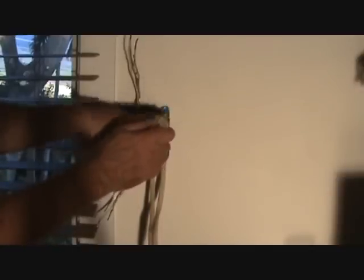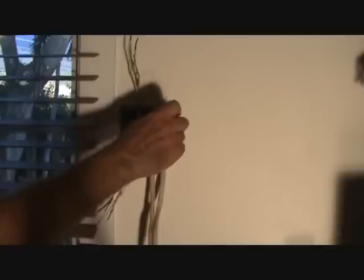Now remember that screw — you put that on there and as you turn this up, you can imagine that flopping up on the backside of the sheetrock right there. Now you can start tightening that and it's starting to draw in on the backside right now. I don't want to make it tight all the way — I want it just a little snug because I want to have enough room to start sliding it around. Now I'm going to put this next one in — it's flopping down and now it's being drawn in to the backside. I'm just going to make it snug first.